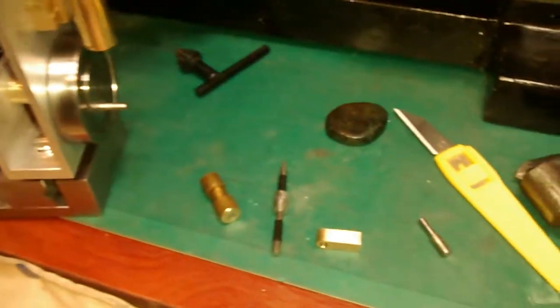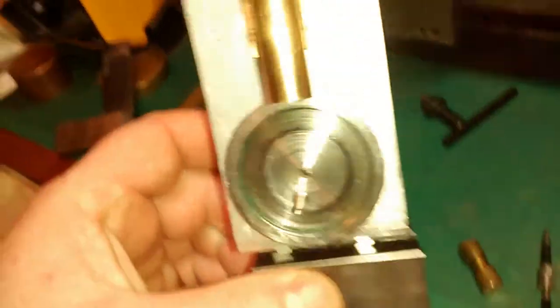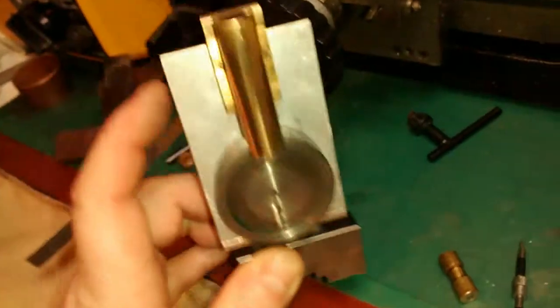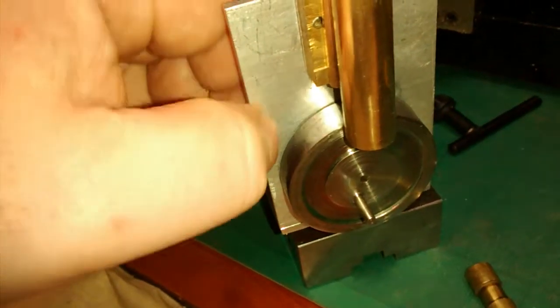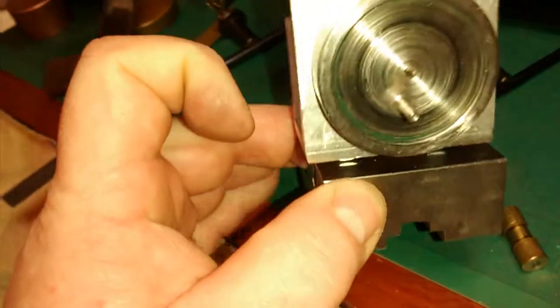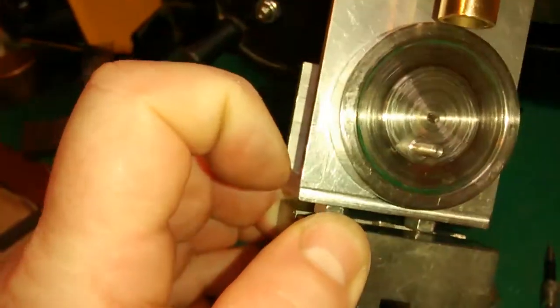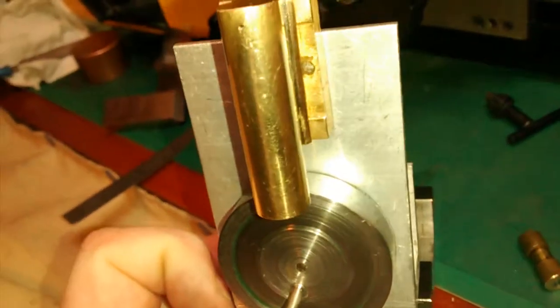But that's it at the moment. I may actually start on the shaping of this frame — this whole piece is going to be cut down, angled from here out to about somewhere around here, then follow the contour of the flywheel down to the bottom where it's going to be cut at a 45-degree angle. There are small scribe lines on it but I don't think you'd be able to see them at the moment.